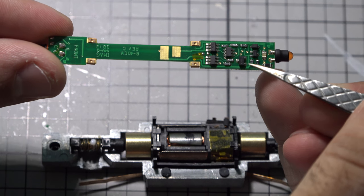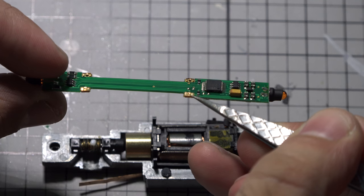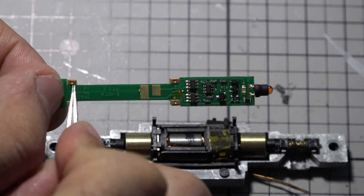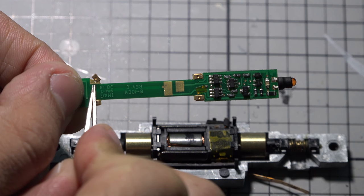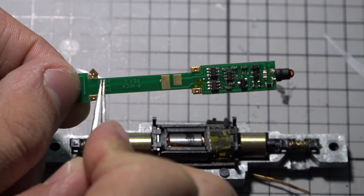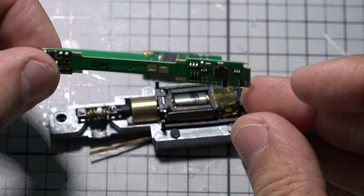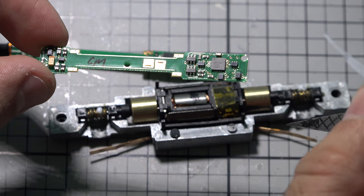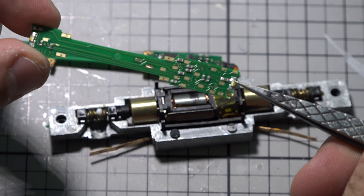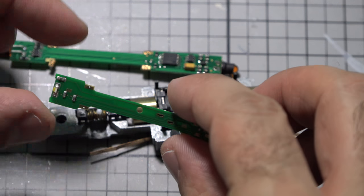From the old board, you'll need these little copper pieces that slide in — you can see them when you pop it out. These are very soft and fragile, so be careful. For the Digitrax decoder, the side with the chips faces closer to the chassis, and the side with barely any chips and the tiny LED lights faces up. Now let's get those copper tabs onto the sides.